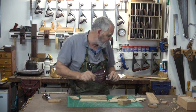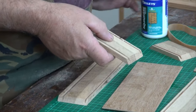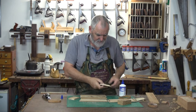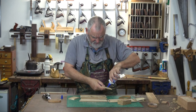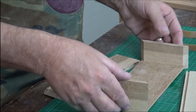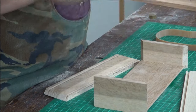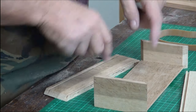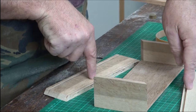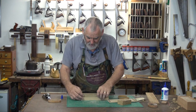So how we get around that — we just put a dab of glue in the centre of the slot. Just a dab, not much at all. Same in the other end, just a squirt. So in doing this, we've held this base in position so it's not going to rattle, it's not going to move. And these two sides can contract and expand as the weather changes. So no glue in the long sides.